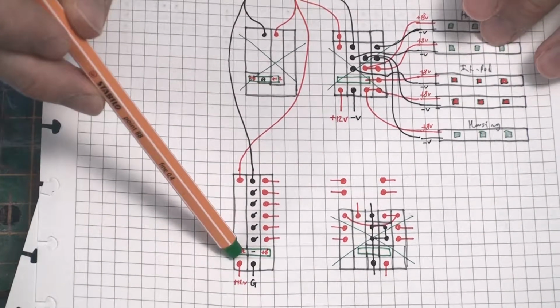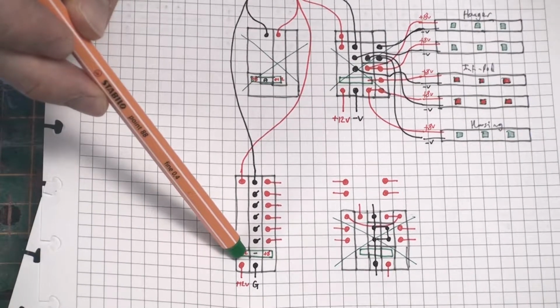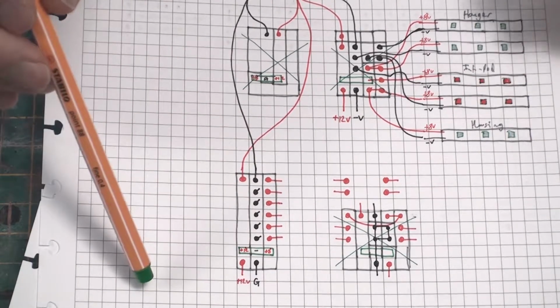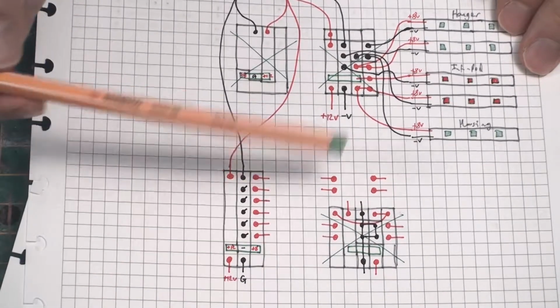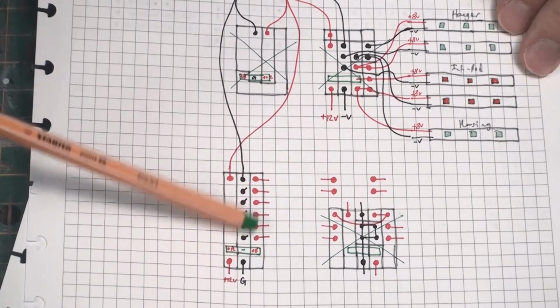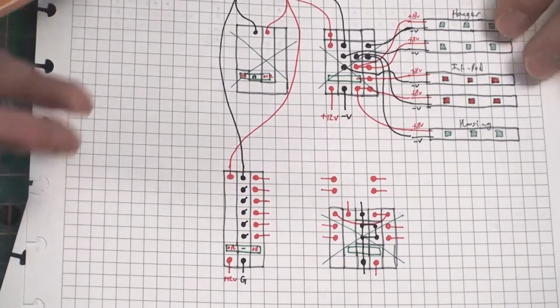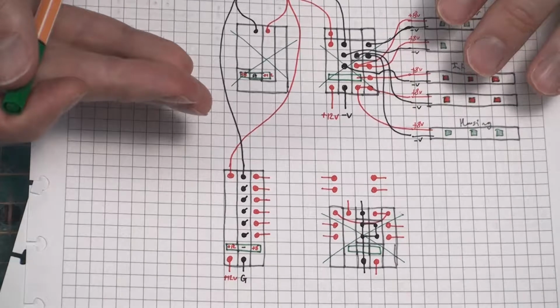To achieve that 8 volts, you could do things like pulse width modulation, but in this case I'm going to use a voltage regulator, which takes it from 12 down to 8. It's a very simple, neat solution, which I'll show you in a moment. Connected to that's the LED tape. There'll be 5 separate strips that come down into the board, and the whole thing just plugs together, much like with Voyager, where there was the central board inside the engineering hull that all the components simply jacked into.